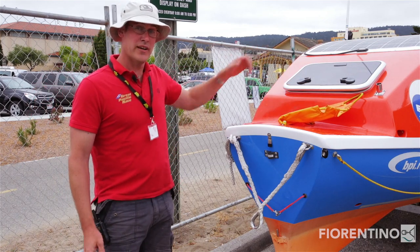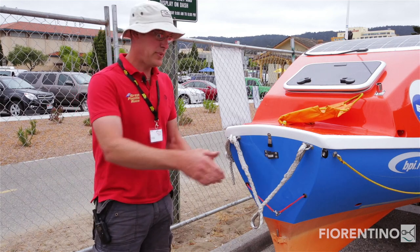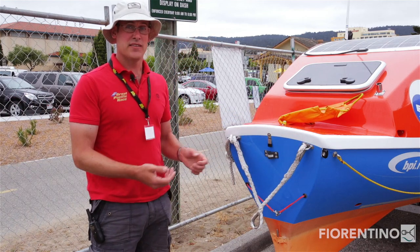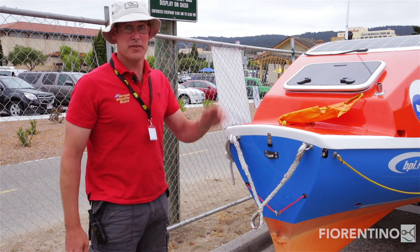So you've actually got the option, if you have to, of just opening the forward hatch, pulling and collapsing the chute line, and then you can pull most of the parachute up to here. And then, of course, the boat's moving again. You're not locked off against it, and you're not going to have so much breaking water landing on the deck. And, of course, you can just row off with it, hanging from the back if you want to as well.